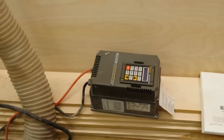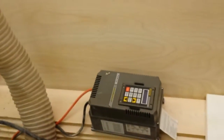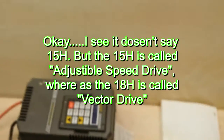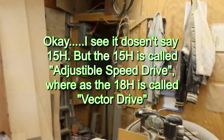This is something I need to readdress. I'm going to have the drive looked at, and depending on the cost I may just replace it. It works fine until you put a load on it, then it goes into a high DC bus voltage fault. I'm fairly fluent with variable frequency drives, but this one is throwing me for a loop. It actually has a story behind it — long story short, it's actually an 18HP vector drive, not a 15HP like the label says, because I swapped the cover from another VFD.